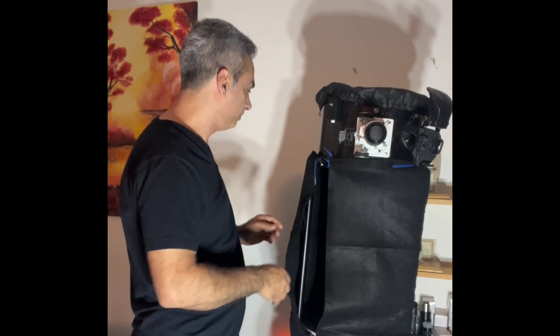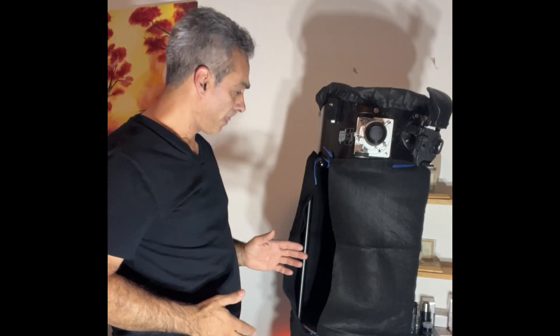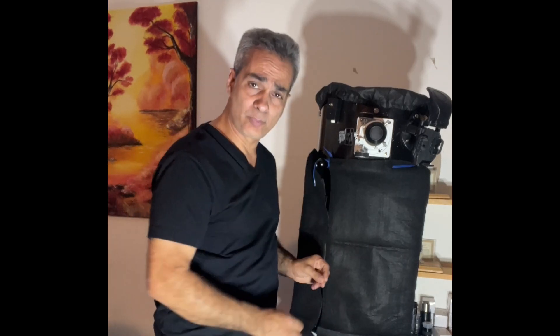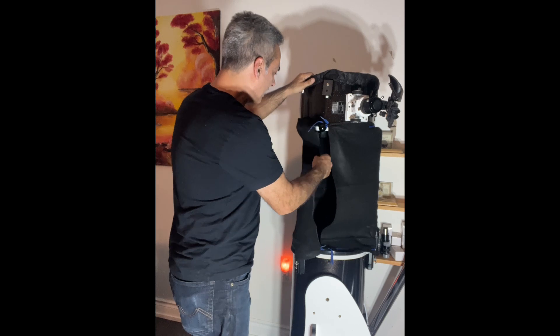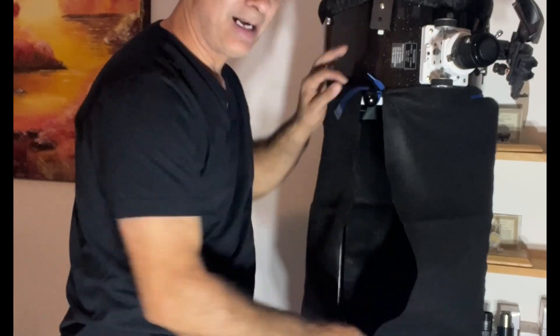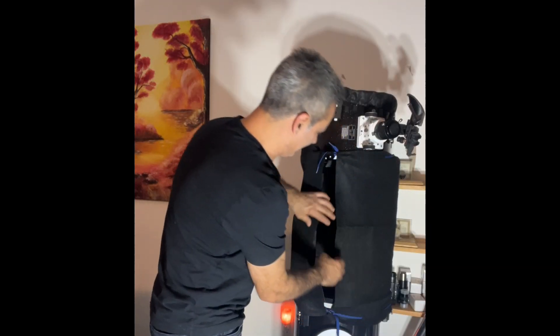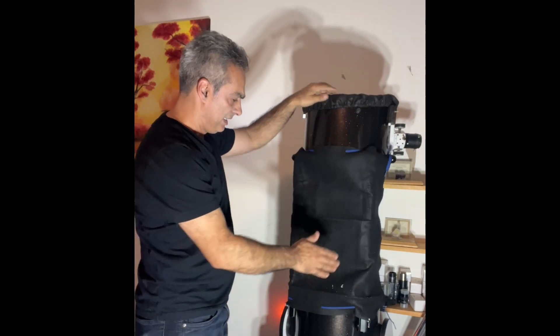There is one little thing I wanted to give an update on, in case some of you guys didn't know and want to build your own. This is a three-truss Dobsonian, and I think I made it just so it fits. But there is another concern besides just gluing it permanently. I think I need to expand the joint here — I'm going to try three to three and a half inches. The reason is when I close it, it becomes kind of tight.